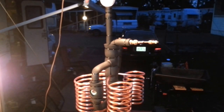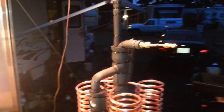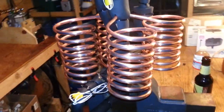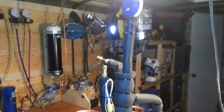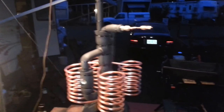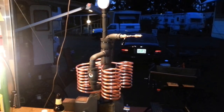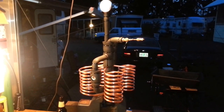That's about 12 hours of work right there. I've got to say I'm pretty pleased with it — it's kind of neat. I've never seen anything like it before. Never seen a DIY flooded evaporator, and I've certainly never seen a flooded evaporator at all, other than in pictures. They're just not commonly used anymore except for 100-ton-plus systems. So hey, if you watched this whole video, good for you for listening through all my boring dialogue. But I'm excited about it. The abulator.